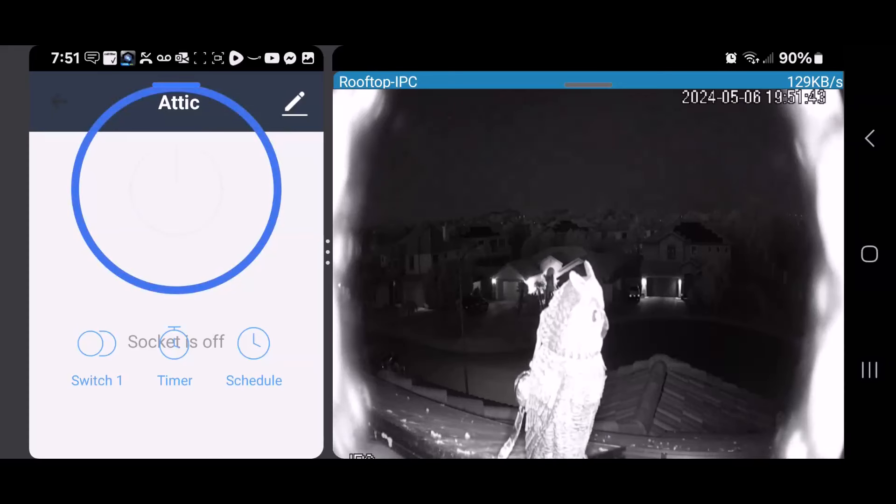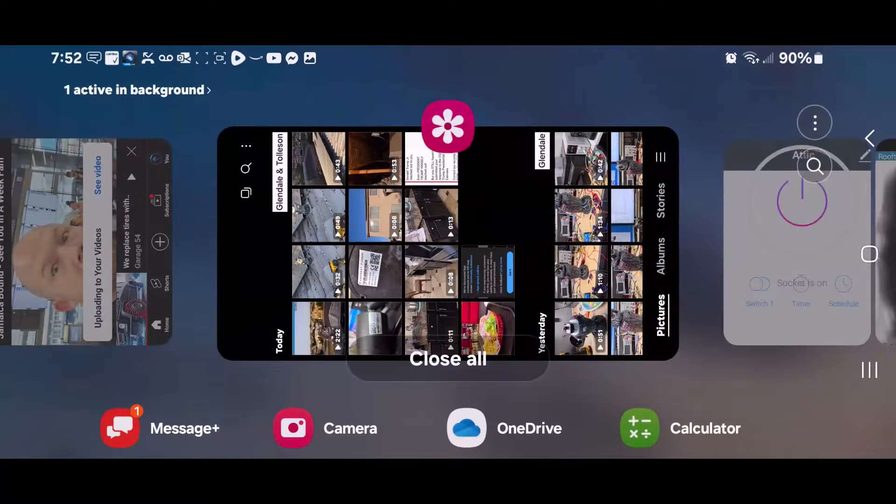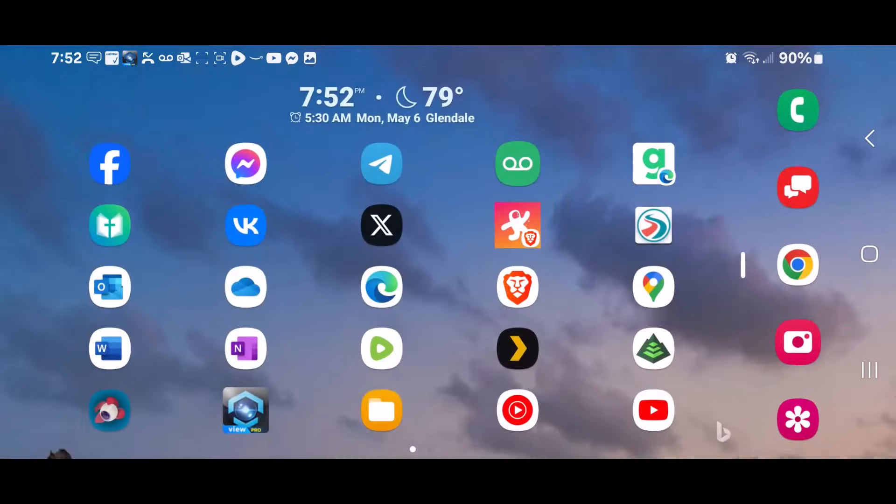What I'm doing right here is using a remote control to turn off that outlet power and then turn it back on, which is going to force a reboot and re-home the head. There is some lag in the video I'm watching - when I turn it back on it's really like one second or so before it does the reboot and re-home, but the video is playing back a little later. I do now wish I put in the code for it to spin the impeller whenever it first boots and homes the head, because I could have always made it do that remotely while watching.